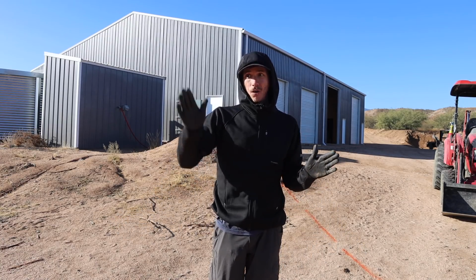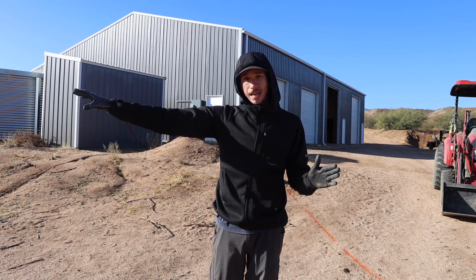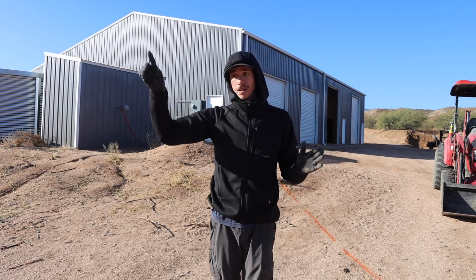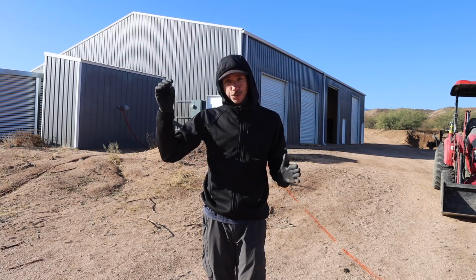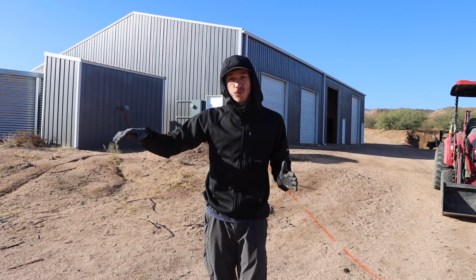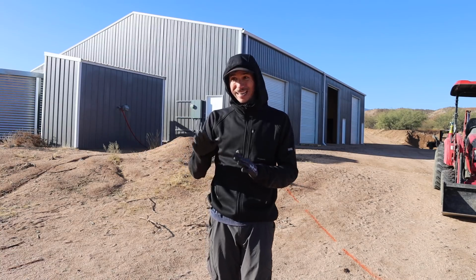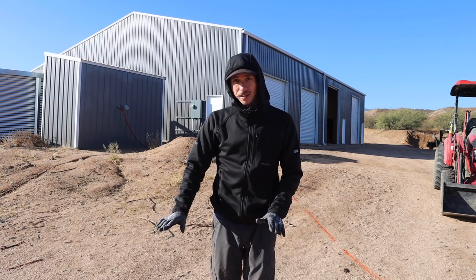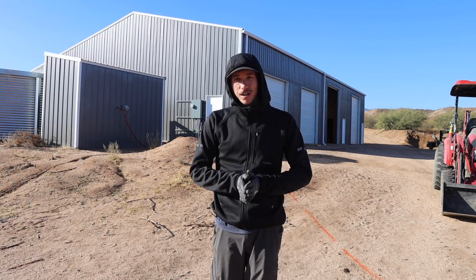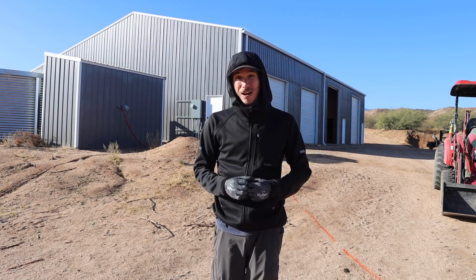Now, I know where my water tank is going to go, so we're going to be installing another 12,000 gallon Aquamate water tank that's going to capture water from the roof of the house. I can get all those pipes underground where the downspouts are going to connect to it, and get it prepped and ready to where the tank is going to go. So I can get all that stuff in underground, get it closed up, then I know I'm not going to have to open this trench up or dig in another spot close to that trench to get things in the ground that I need.